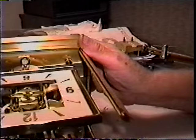This is the roller. I showed you how to put the regulator into the roller so that it's centered, and then how to poise it. Make sure that the regulator is in the center. Whichever way it's rubbing, it hangs up here on the pair of pliers like I showed you. Put a pair of pliers into a vise to hold it if you want. Put the wire into the pliers and clamp it tight so it hangs nice and free. Then you can see which way that pipe is leaning. If it's leaning this way, you have to go the opposite way. If it's leaning that way, you have to pull the pipe back. So whichever way you're going, your poising tool will do that for you.